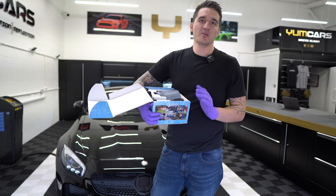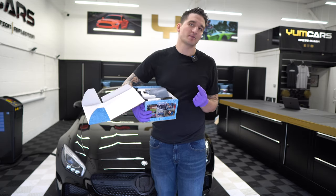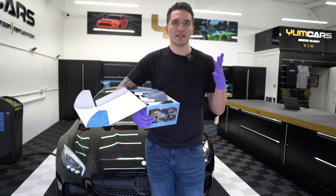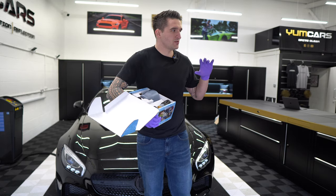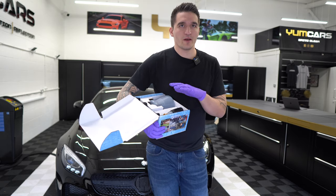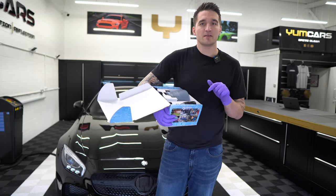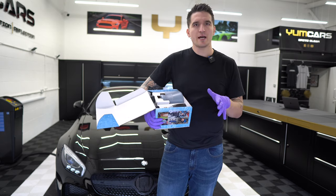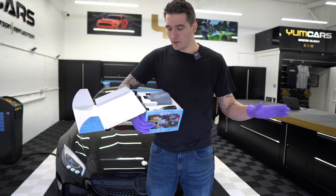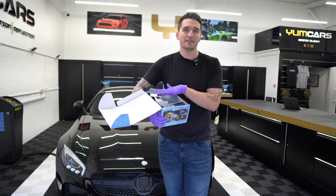Within this box, it comes with everything you need to have a plug-and-play system. If you've got any iteration of a Kranzle and you're using their standard M22 with brass fittings, or you've got a cheaper variant, all you need to do is buy the 3/8 quick coupler, torque that down on your Kranzle. You can buy the parts separately, but the PF-22 and the SGS-28 come together in this kit.